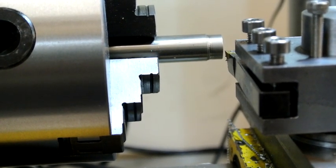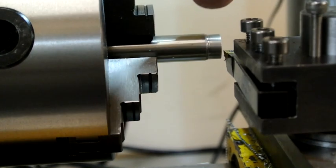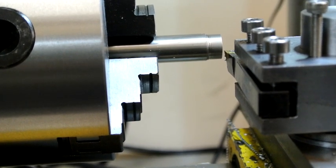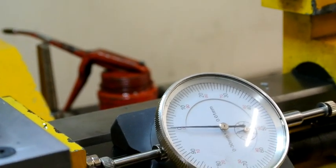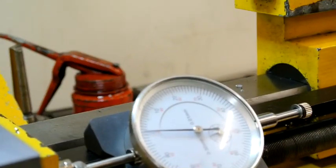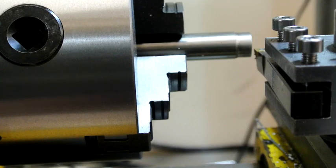I've now taken off the previous tool post with the retracting tool holder, so I'm back to the standard tool holder with an ordinary facing tool. This is stainless steel and I'll just turn a little bit down so you can see it can cope with turning. Down here is the dial gauge which will measure as the tool moves, so I can measure exactly how much the tool is going to go in despite the fact it's only manual. Let's give that a go and touch off.